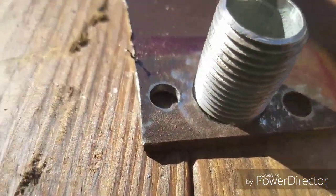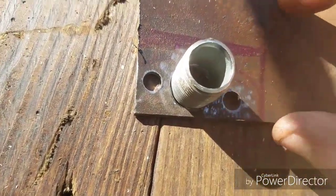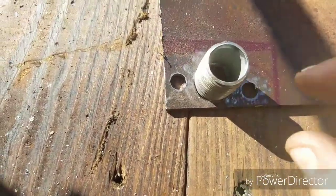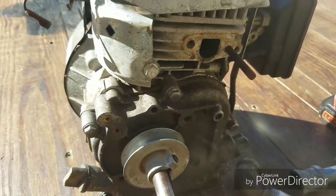I'm gonna go ahead and run a few tack welds and might actually weld it solid before I cut it out - that way I've got more metal to draw the heat away and keep it from warping. I'll throw a few welds on this real quick and come back once it's welded and cut out, and we'll slap it on the engine.